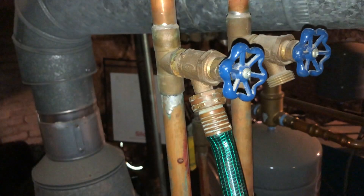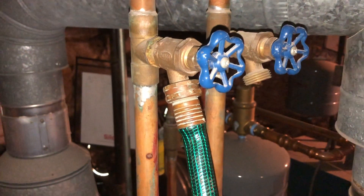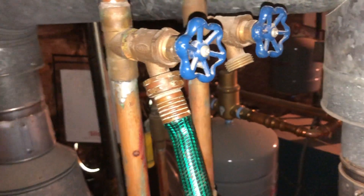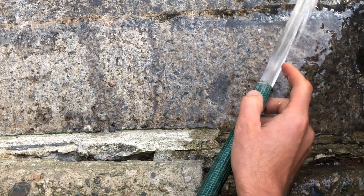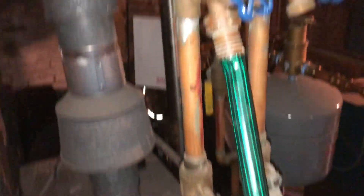You don't need to apply a lot of pressure on the valve, or even fully open it in most cases — the system will automatically put water into your system. And now we're bleeding. We could let that rest; for this simple circuit, a 900-square-foot apartment in two zones, we're gonna let this run for five minutes. Any air in the line should come out of this hose as it comes through. Water is coming from the city, through this pipe, pulled through the boiler, up to the heating circuit, blowing out any air, and then back out.